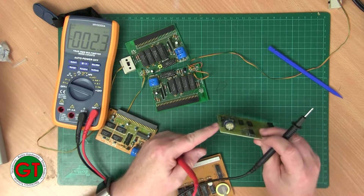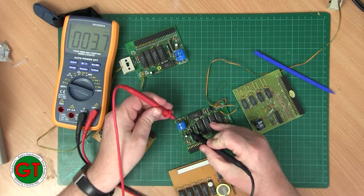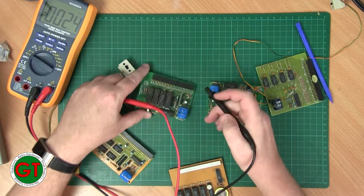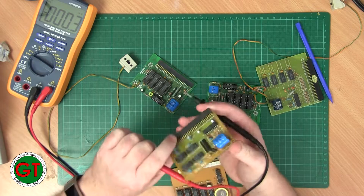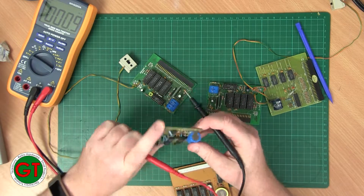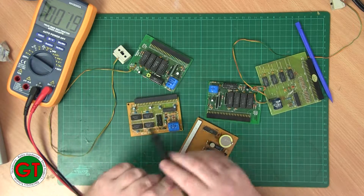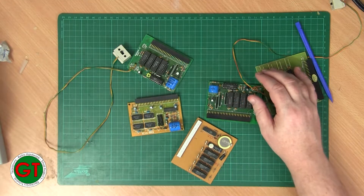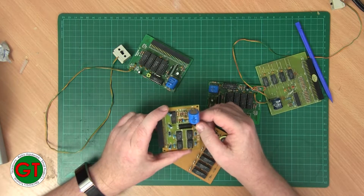This one's nice and furry, so that's definitely got to go. This one has some signs of leakage but not a huge amount — again millivolts. This one has a little bit of leakage on it, not a huge amount either. This one seems to have no signs of leakage on the actual battery, but there is a bit of green around some of these components. I think what happened is that I got all these cards from the same seller, so maybe they've all been piled in a box and one of the others has dripped fluid down onto the board and caused the damage.